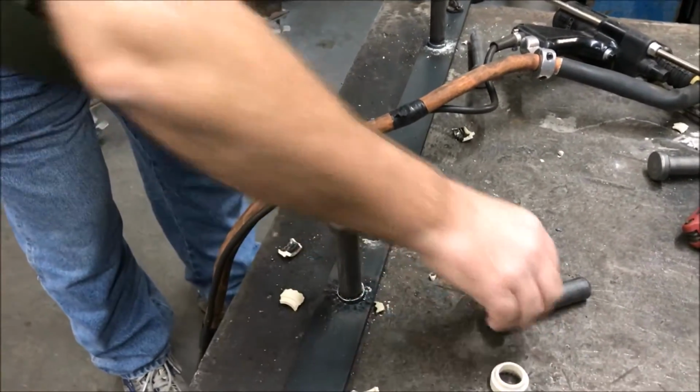As you're welding with this, you'll develop a sense of what you're hearing. At first, it all kind of jumbles together, but after you've done it a few times, you'll hear what's going on with the stud. During the weld process, what you want to hear is a consistent sound all the way through, from beginning to end. If at the end of the weld cycle you hear a change in the pitch, you're too long, your time is too long.